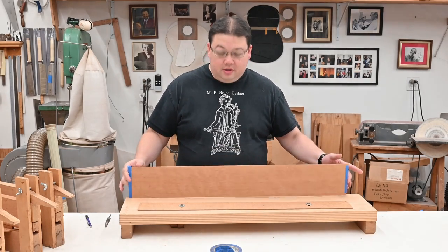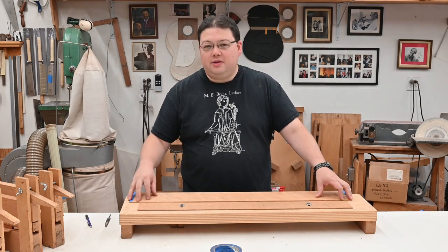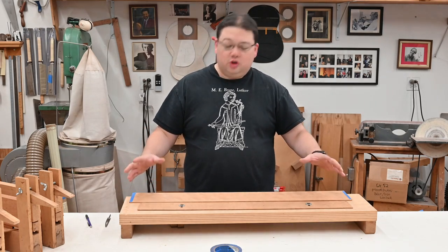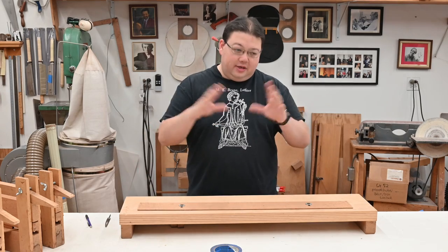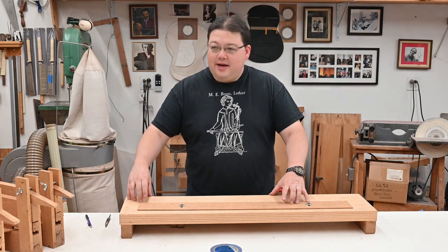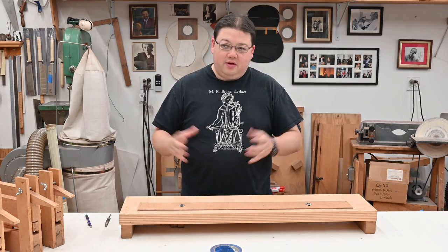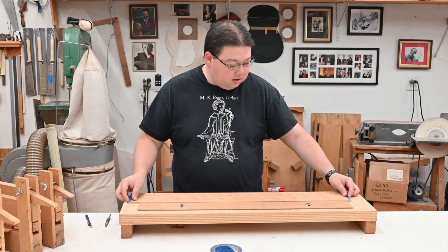Now that we've got this in place, I like to get a little bit of extra room on the sides for bending. I don't use one of those fancy side benders — I'm a blowtorch and a pipe kind of a guy. I like to have a minimum 30 and a half inches between my front and back edges; it gives me just enough room to not burn my fingers too badly. One of the other things is to figure out your depth. Because this is going to be a slightly smaller bodied guitar — it's a 635 scale — I want to make it slightly deeper. Normally my neck end is 91 to about 95, 96 at the tail. So I might go a few millimeters deeper, say 93 to about 97 or 98. It's going to be a little bit of a thicker guitar.